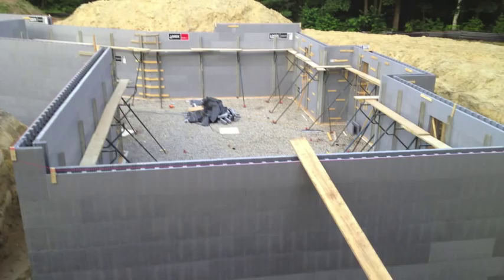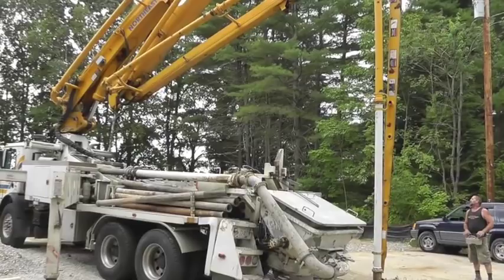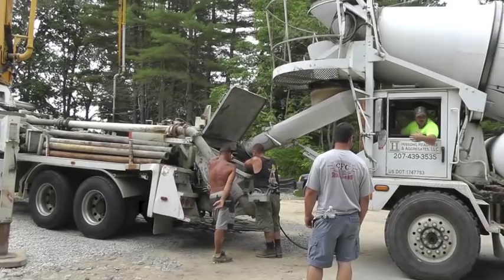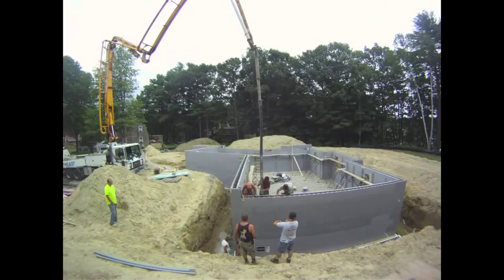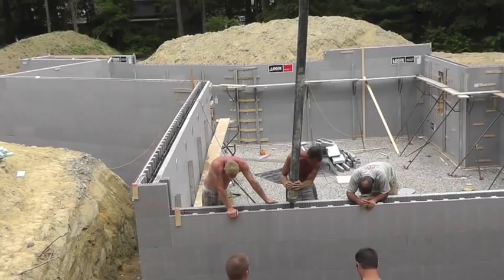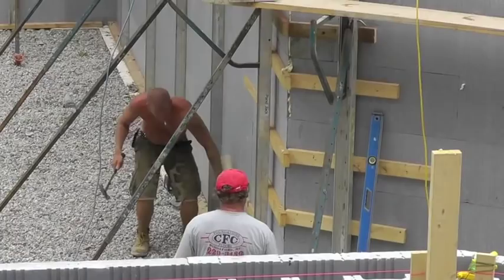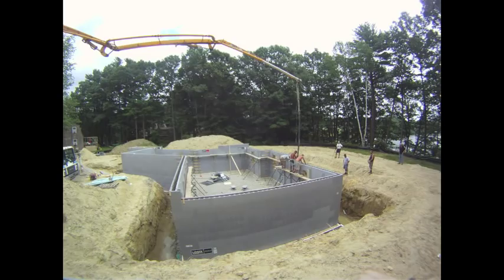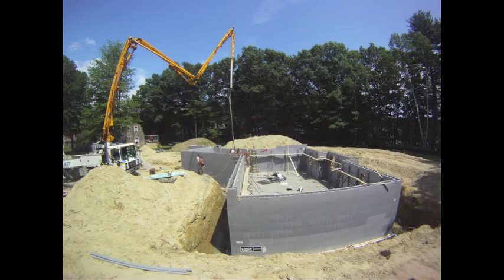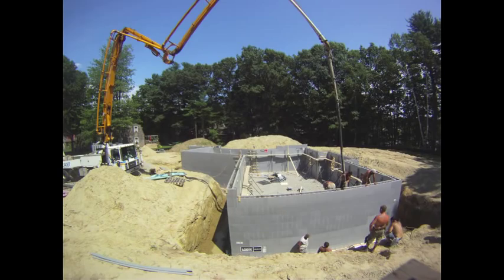Let's bring on the concrete. First to arrive is the pump truck, followed by what will be one of seven cement trucks. While the crew makes sure the concrete flows evenly to both sides of the hose, others bang the inner and outer sides of the block to vibrate and settle the concrete. The crew was a bit tense at the start — a breach in the ICF wall while pouring the concrete can make for an expensive repair and a messy clean-up.